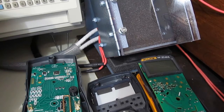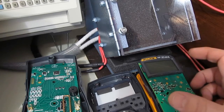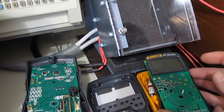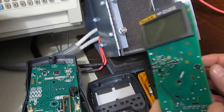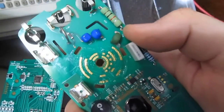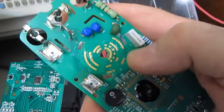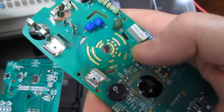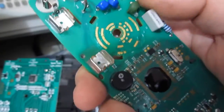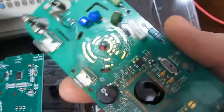This is going to be a short video where I talk about the fuses used in some of these meters. These two meters were provided by 5KY. This is the Fluke 107. If you watched the video where I damaged this meter at 15,000 volts, you know that this area of the circuit board sustained some damage. I cleaned it up the best I could, re-soldered the PTC, and changed out the damaged diodes. So this meter is 100% functional.